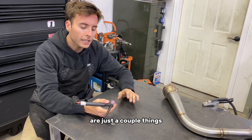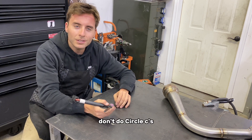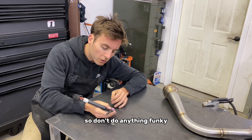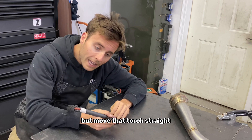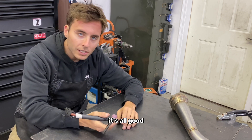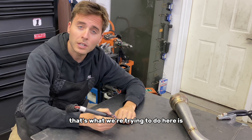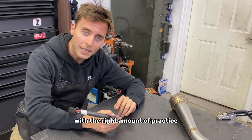The last things I want to mention before we start welding: when you're welding exhaust, just move the torch straight. Don't do any sort of movements, don't do circle C's — that's for other stuff. In TIG welding you very seldom move the torch; it's mostly just straight movement. Every once in a while you've got to move it around a little bit to stabilize the puddle, and that'll come with time. But move that torch straight and rotate it — remember to rotate. And most importantly, be calm. If you touch the tungsten, if you ruin the tungsten, it's not a big deal. Breathe when you're welding, dip, count, and just get comfortable. With the right amount of practice, you'll be rolling good.